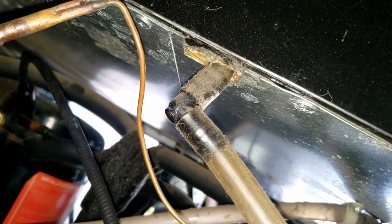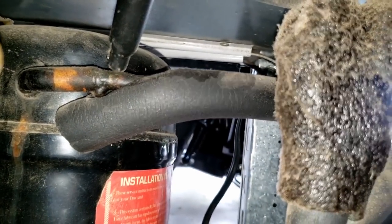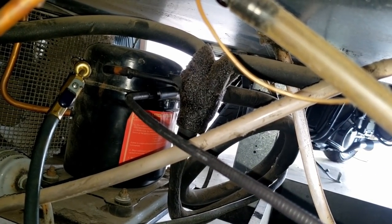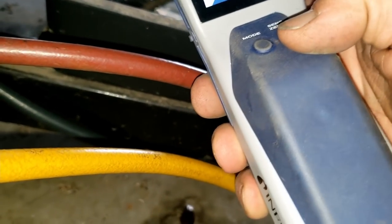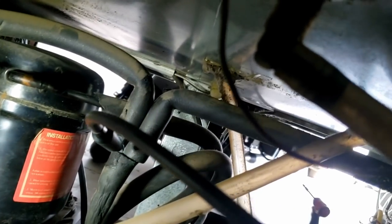Haven't checked inside yet but I've got down here to the old suction port — and she doesn't like that. Nothing there on medium sensitivity. Coming over to the insulation area — we're getting something in the insulation. Not getting it on that part at higher sensitivity, let's just go high instead of super. Something in that suction line — so we peeled that off. Not getting anything on that, so let's come down and over into this bend.